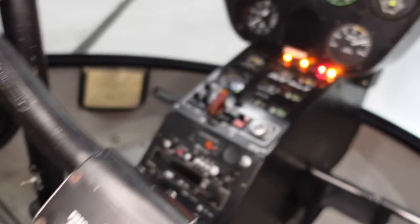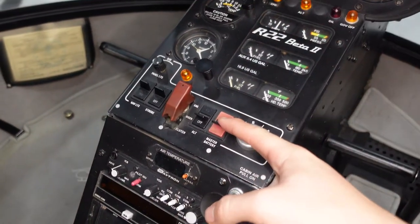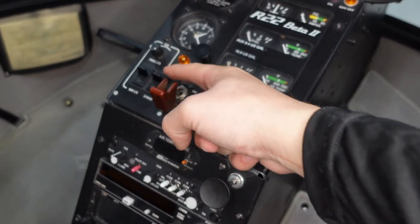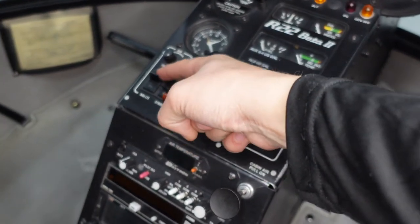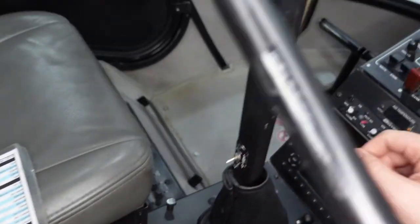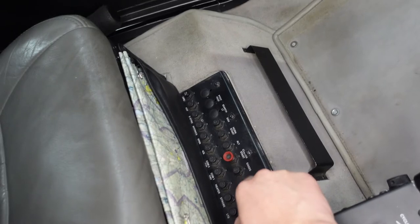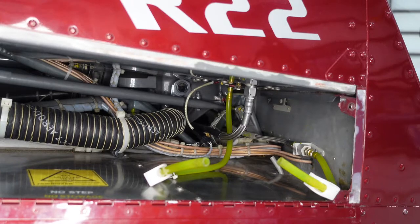When I'm done with that, I'll come back in here. Master battery off, clutch disengaged, strobe off, nav lights off, landing light off, and the clutch circuit breaker — the big red one — goes back in. That's the first check I do when I get out here, and then we'll actually start making our way through the checklist. You can go through it however you want, but do use a checklist.